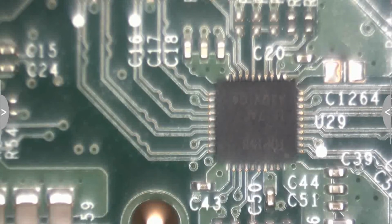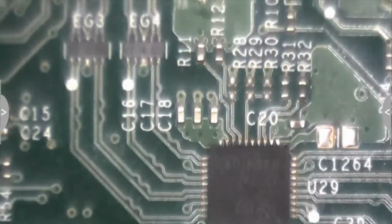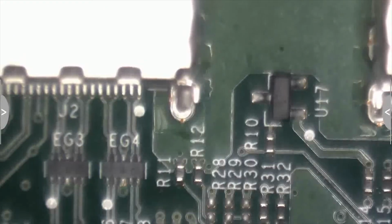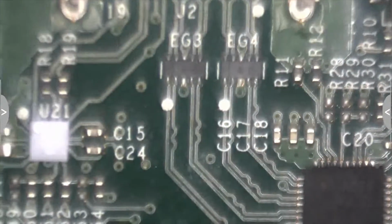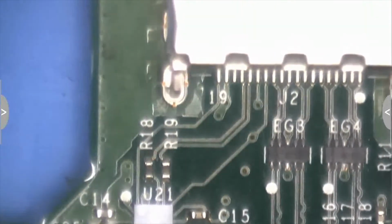So, normally, at least it's my understanding that these get damaged when an HDMI port is physically damaged and pins end up shorting each other, other weird things of that nature. So, not 100% sure how that guy would get damaged on this particular one. So before we jump to that conclusion, let's just do a little bit more visual inspection, just make sure nothing else looks screwy.